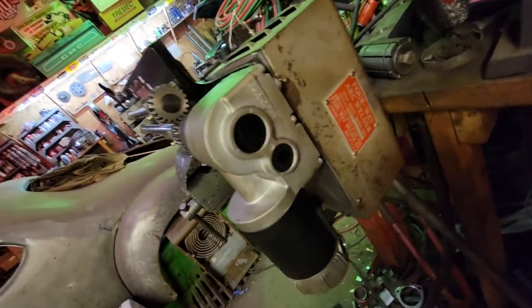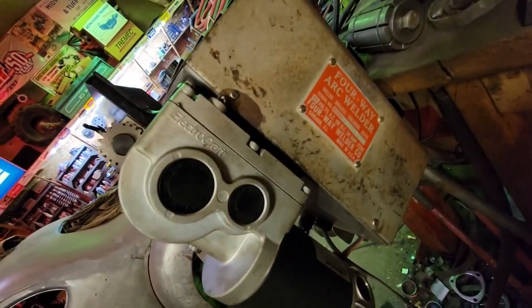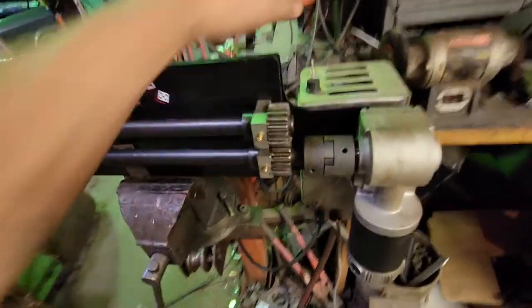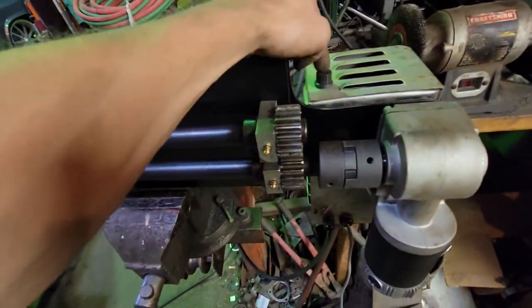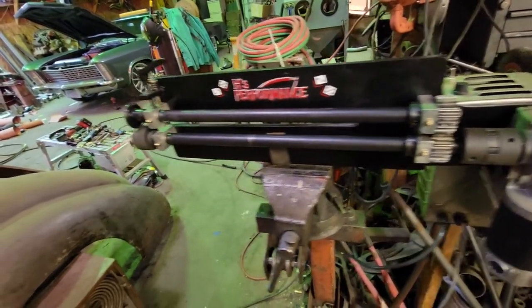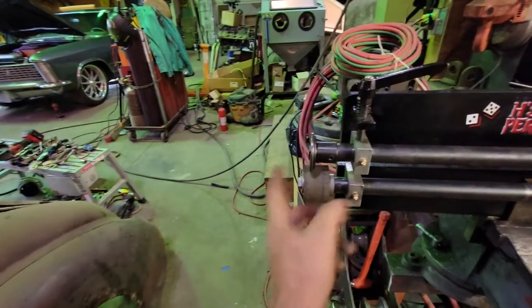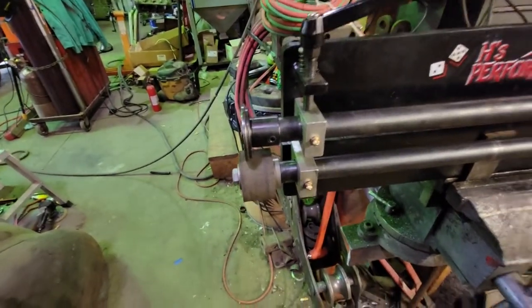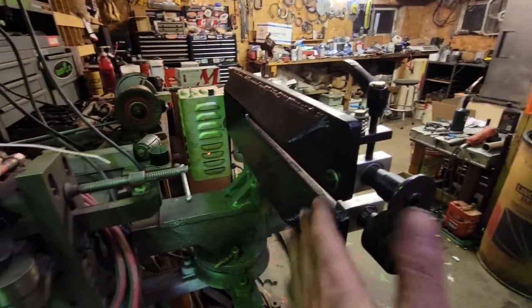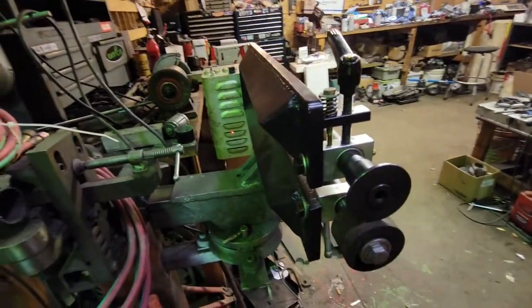Here's my English wheel — I built it a couple years ago with the old Duramax ring gear for an adjuster. And here's my Eastwood bead roller. I've converted it to a 12-volt gear reduction motor — kind of a cool old housing I used for electronics. Apparently that old arc welder burned down a lot of houses and was recalled back in the day. I've got variable speed and a foot pedal — forward and reverse. I did the raised section in the panel using the rubber wheel and just part of a step die. I've also got the back side reinforced with angle iron, otherwise it'll twist and flex on you.